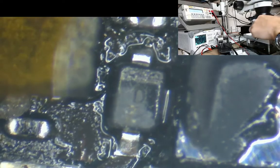The problem we've got here with leaving this chip in here is that it's underfilled. So there's always a chance that heating it up could cause the underfill, when the balls melt, to create pressure underneath, which then causes the solder to just blob out. It's got nowhere to go because it's underfilled, and you end up short-circuiting. So that's the issue, really.